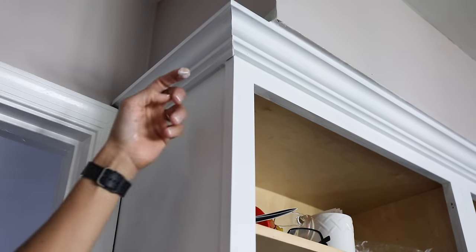After two coats of Beyond Paint, it was time to move on to the sealer — this is a very important step. What I like about Beyond Paint is that they offer a multi-purpose sealer for extra durability. There's already sealer in Beyond Paint, but for kitchen cabinets that people are touching all the time, you want to add some additional protection. It goes on milky but dries clear, so don't be alarmed. I applied it the same way — wait 24 hours for the paint to dry, then use a paintbrush to get into all the crevices, and follow up with the roller to even everything out.